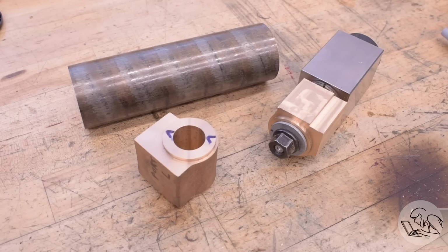It's the side of the steam chest right on the side of the locomotive where everybody's looking, and any kind of repair I think is going to be visible. And this is also cast material, and silver soldering and brazing cast metals is different than bar stock metals. It's not something I have a lot of experience with, so I didn't like my odds of success on that. That all led me to consider what are the actual consequences of that one dimension being 20 thousandths under. I mean, 20 thousandths is not a lot. It's not great. We do try to do better than that around here, but it's not terrible.